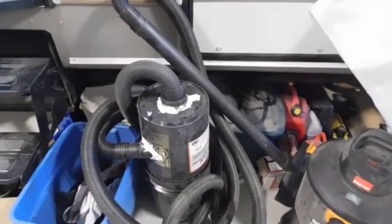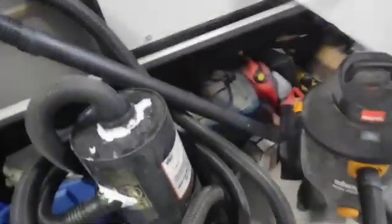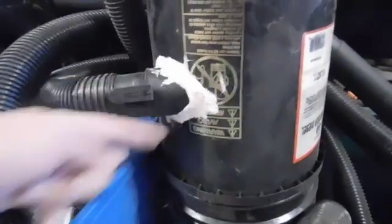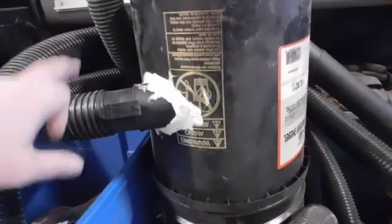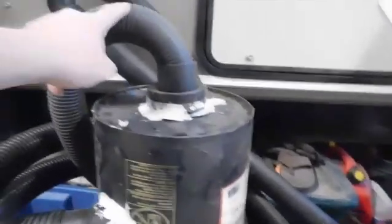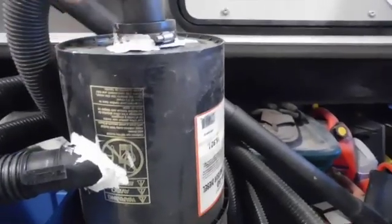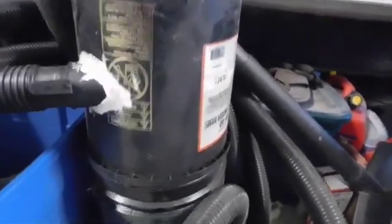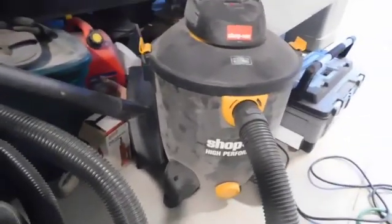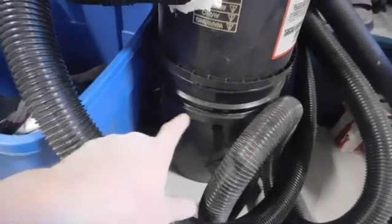We're on our way. Just a little side note, I made myself a cyclone or whatever. Took 2 oil drums, mounted them like this, one on top of the other. Just cut a hole in here, got a vacuum straight little extension stick in there. That goes out to the suction end, or to the vacuuming end. At the top, I just cut a hole in there and put the hose in from the vacuum coming in here. So this sucks in this way, this sucks in this way. You get that cyclone action. After 2 weeks of doing a lot of sanding and sucking, there's absolutely nothing in the vacuum, and it's all in the bottom of this thing.